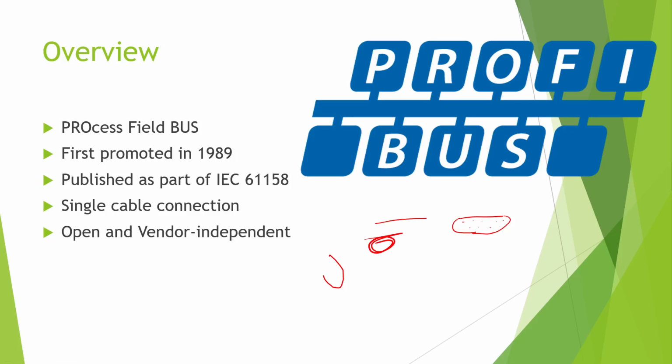So this is open vendor. That's nice. Siemens in Europe, definitely kind of the go-to one, as you guys saw. Like that thing just kicked Allen Bradley's butt. So nearly universal there. Profibus was used all over the place there. And this is, again, kind of an older standard. Profinet, which we'll talk about at the very end of this, has come up and taken over. It's basically replaced Profibus, which is kind of interesting.